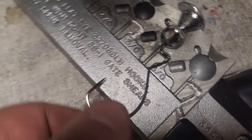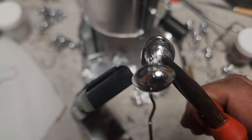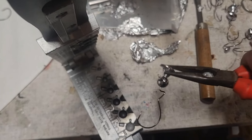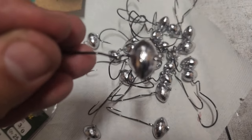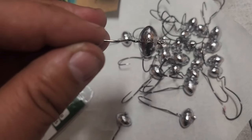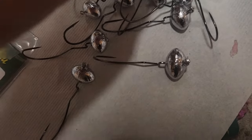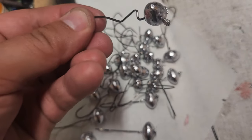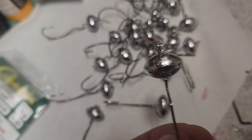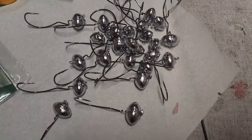I just poured one. Got to clean up the eye a little bit. Success! They came out pretty well. The only thing is there's a little bit of buildup on the wire form area, so I got to take a file to it — but not too bad. Other than that, they came out great. Just a little bit of lead to clean up where the wire form is. They came out pretty clean. The JW jig, full effect.